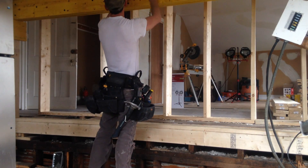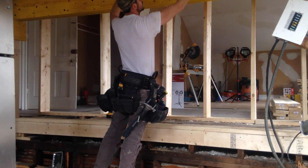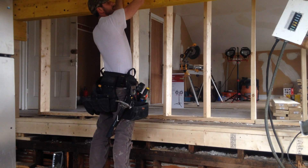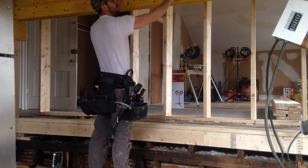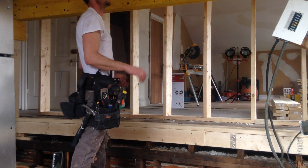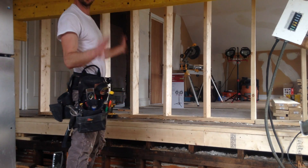After we get this fully up — as you can see the rafters run very straight but they're not sitting level on top of this. So I have not screwed the top up yet, because I'm going to have to shim underneath the rafters to level out this board. We're just going to snug that up and go about that after. We'll put in the support beams and then I'll show you how to build your posts.